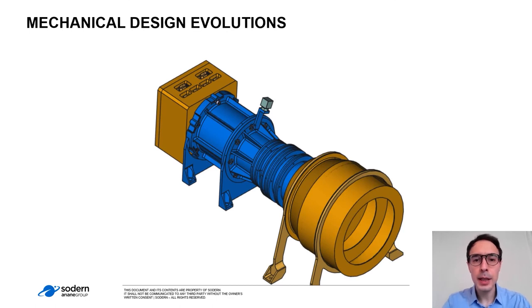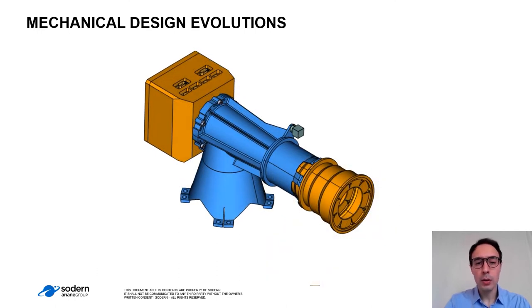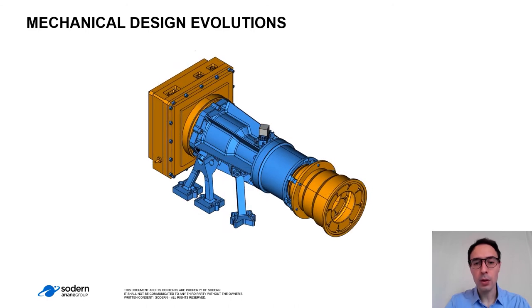The first design included a pupil diameter of 80 millimeters, which was an issue because it led to a mass that was quite high for the navigation camera. Thanks to the models presented before and the electronic filtering, we were able to optimize the signal-to-noise ratio of the stars to reduce the pupil diameter to 50 millimeters. We also worked on the mechanical interface, which was a cone system compliant with regard to thermal conductance. After some co-engineering with Airbus, the line of sight was reduced. By reducing the line of sight, the cone conductance was no longer compliant, so we needed to switch to a bipod system.